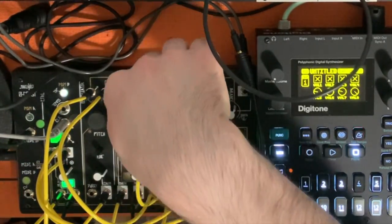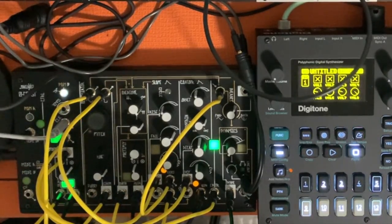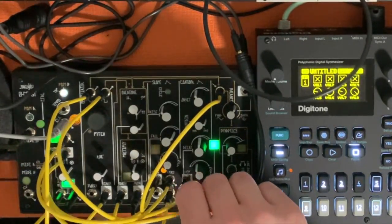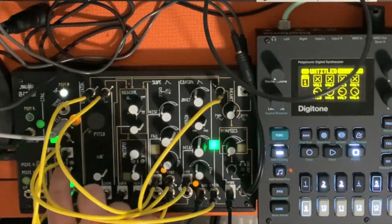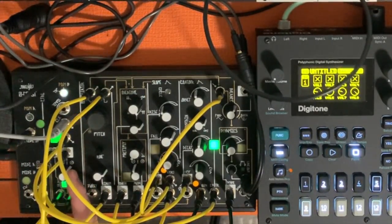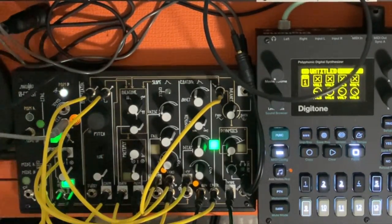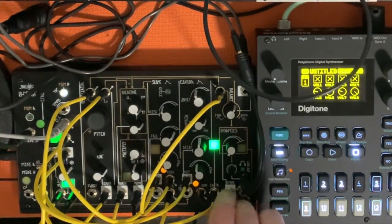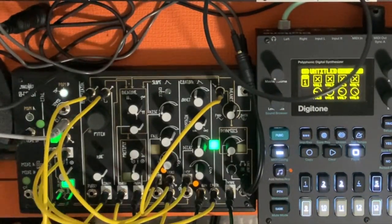But if we also add in the slope circuit, when we cycle it, we can get this almost dual sort of delay-ish, sort of glitchy gate input. So what I have is the contour going into the unattenuated out. Originally, I had flipped them. And the slope going into the attenuverted input. And then basically sending one of the signals to the dynamic input, and the other eventually I sent to the overtone circuit. So both the harmonics and the gate were being opened at the same time, which increased the frequency spectrum that was being played, basically.